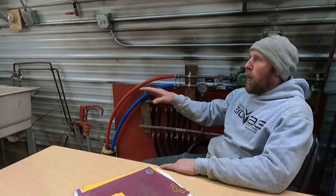So when they threw a transit on it, we were at 18 inches. And then I thought, now what do we do? Are we going to build a shop with a floor that's an 18-inch drop in 80 feet? And it really got me thinking, what should we do? Should we have a ramp on each end and level off the center? Well, I decided we were just going to build a straight, flat floor from one end to the other with an 18-inch drop in 80 feet.